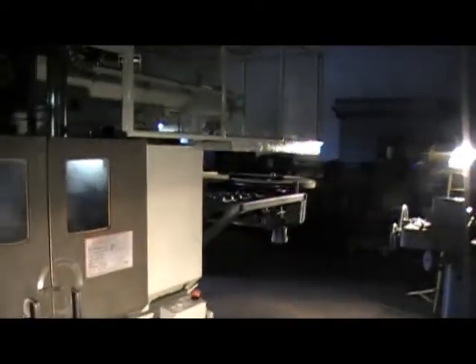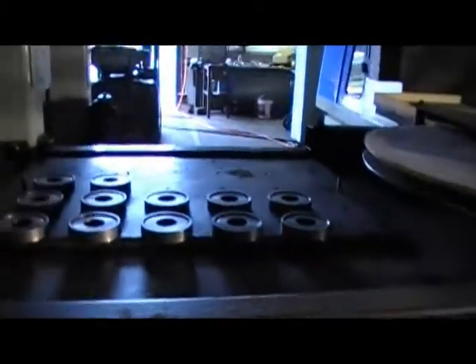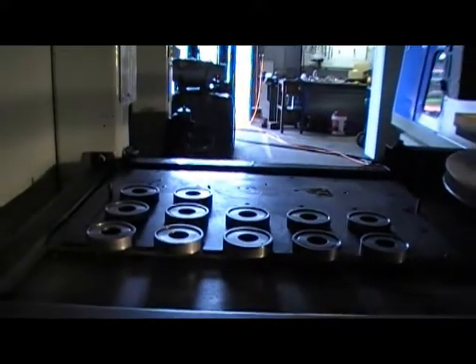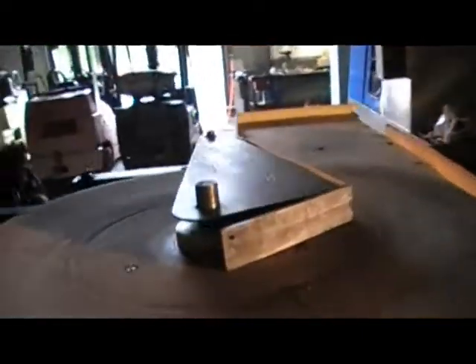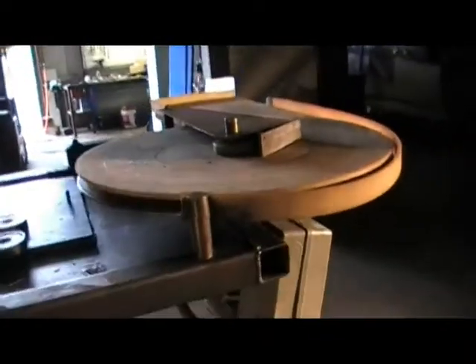I have it set up on a small stacker table right here, which we set up for a customer in a previous operation. He ran 12 parts on it, but you can actually put more depending on where you place your part holders. The table rotates, and when the gantry loader drops a part, the conveyor goes out — you can use different conveyors or this stacker table depending on your parts.